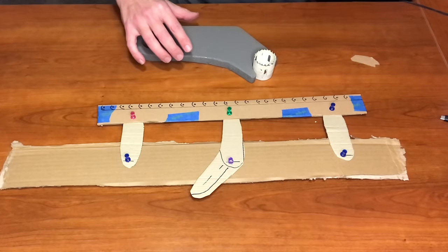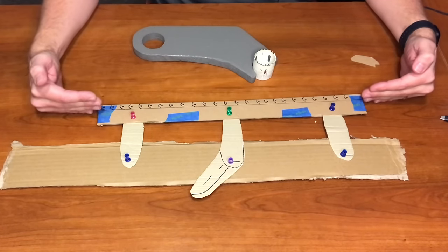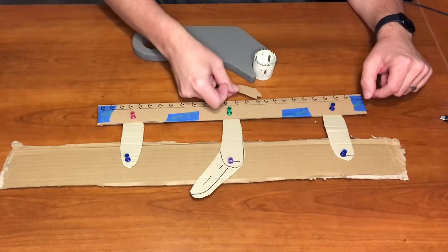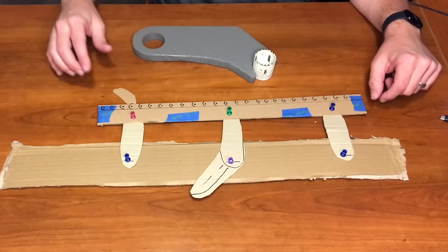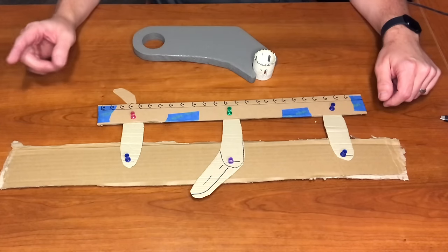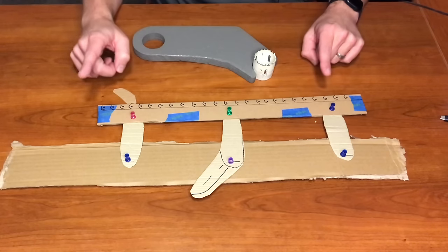So we accomplish that simply by dropping the chain trough. We move it closer from this position right here. We move it closer to the structure all of a sudden. So you have your chain dog right up here, clack, clack, clack, clack, clack, and then it jams onto there. And then once it gets up towards the very top, remember there's two proximity sensors up there. One is the I'm high enough. It's actually measured on both sides of the train. The first set is the I'm high enough, go ahead and drop the chain trough.